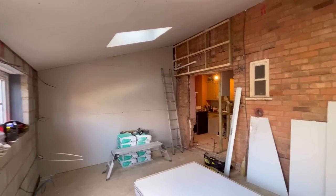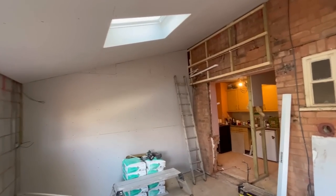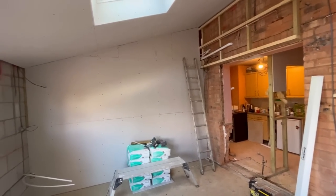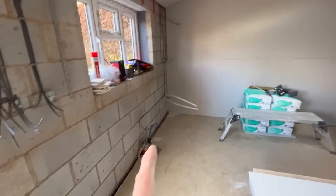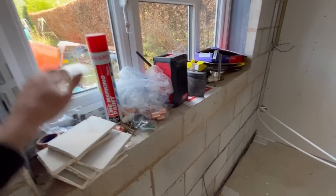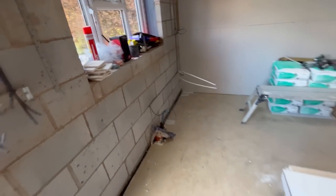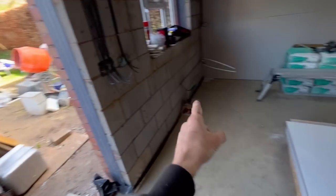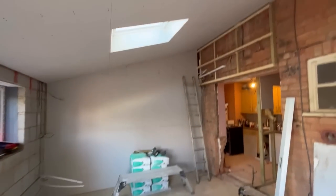We've caught it at the end of the time lapse, then. The gas engineer's just turned up. So we're going to carry on and get the other water feeds done. Mick has just gone to fetch the connector for the connection outside, because the one we've got wasn't what it was said to be at Screwfix. It said it was a universal, but it's not. So we're going to a proper plumber's merchants now to get the connection, as I've already showed you for outside, which is the MDPE blue pipe to copper. But this is complete.